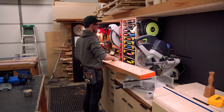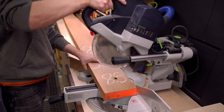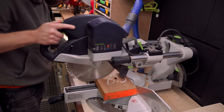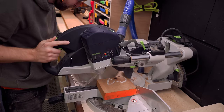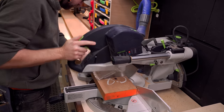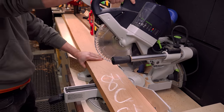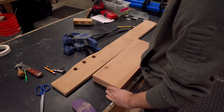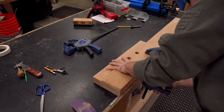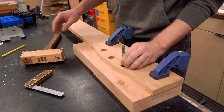That sideboard is going to form the inside of the vise, and for the outer jaw of the vise I'm going to be using this cherry. I don't use a lot of cherry in my shop and I'm not that familiar with it, but it is pretty affordable right now and it's a pretty hard wood. It's kind of in that nice middle zone between hard and soft which for vise jaws I think is perfect — you don't want it to be super hard to crush your material but you also want it to stand up over time.